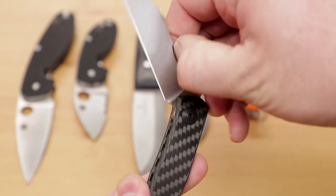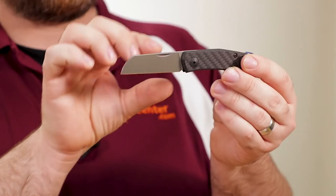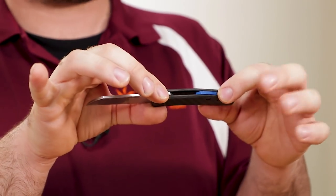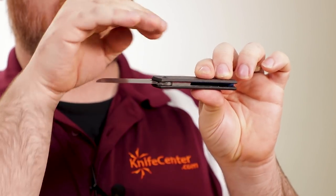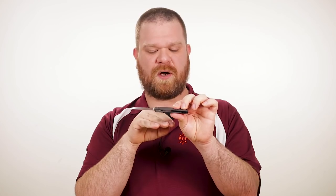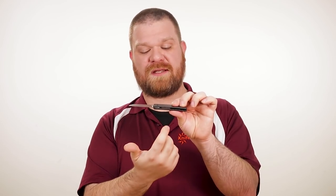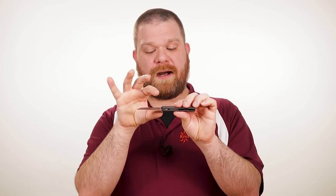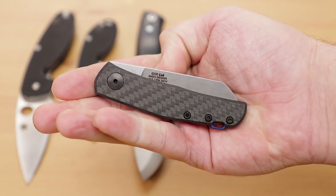This is a non-locking knife. It's designed by Jens Anso — however you want to pronounce it, pretty sure it's Jens, but maybe he'll comment and let us know. It's a cool little non-locking knife. It's not quite a slip joint because it doesn't have a back spring. If you look in from the front, it looks like there's two different liners, almost like you'd see on a liner lock on each side. They don't actually engage the tang of the blade, but both of those strips of metal act on the side of the blade as a dual detent system, which gives it a little bit more strength than a single detent.